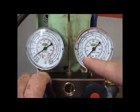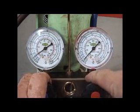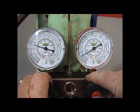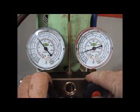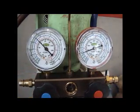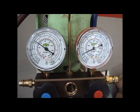Watch the red gauge here. What comes on the blue gauge should come on the red gauge. Now, oxygen-free nitrogen can be used for several things. Number one, pressure testing — you can see you've got a leak there. See it going down?